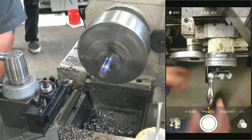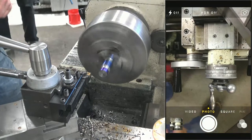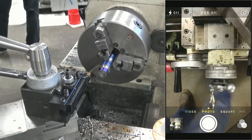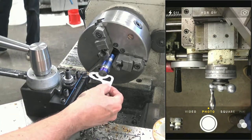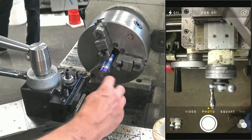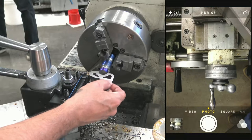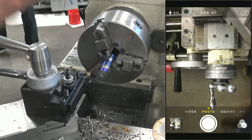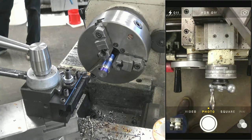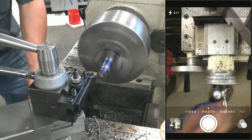Okay? So, I like using this cutter for it. And if you can picture this thing, if you can get a visual of what you should be looking at when we're done. All the material is coming off of these corners, okay? So I'm going to spend all my time on these corners. Don't know if that made any sense to you, but being able to visualize what you're fixing to do will usually help you. All right, so a little bit off of this corner first.